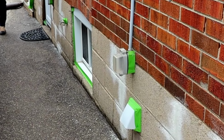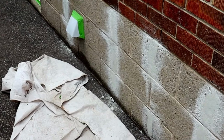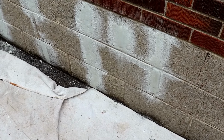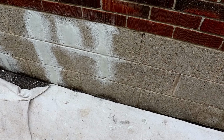Here, the crew continue to apply the compound to any difficult areas of the foundation where erosion has occurred. You can see here the cementitious material applied to the more eroded areas of the foundation, that it will fill in the difficult areas while still showing the block formation of the structure once the SurGuard gets applied.